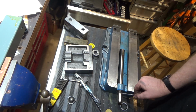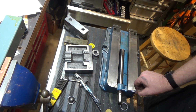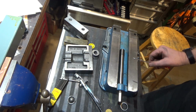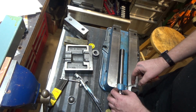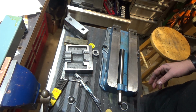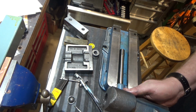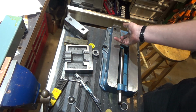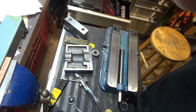The slip rings, just a screwdriver. It's like a Jesus clip with a C-clip, except it's 3 parts. So you just get one side started and thread it around. Alright, so now I'm just going to reverse the operation, get this guy back on. I'm going to stone the smooth parts here just to get rid of any burrs. That's not critically ground or anything, and I'll be right back.